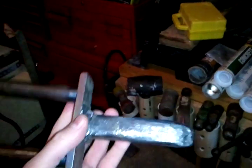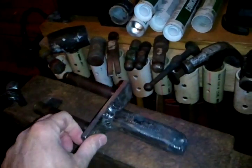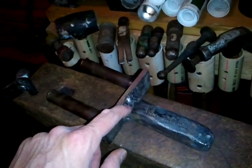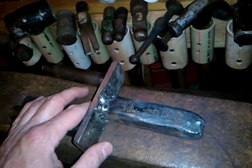I also made another hardy tool in the forge today, and it's for bending stuff. You take a piece of stock, heat it up, and put it in there to bend the item. I didn't have enough metal to make a one-inch wide piece, but I had a couple of strips of material and welded them all together — four of them — with a stick welder, then put them in the forge, beat the crap out of it, and shaped it for the hardy hole.